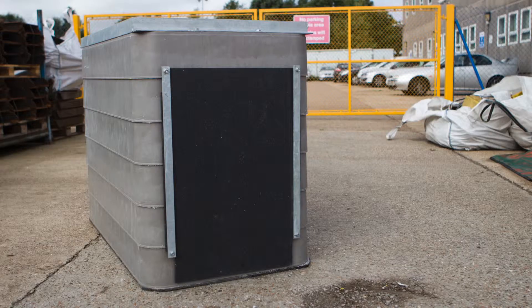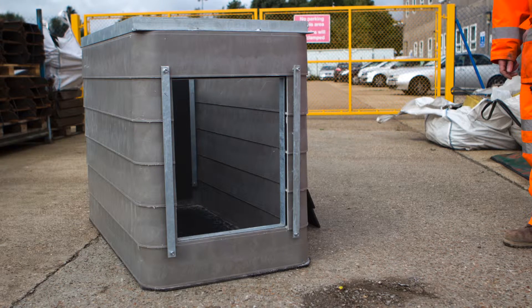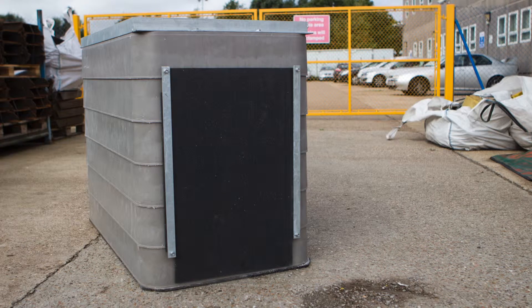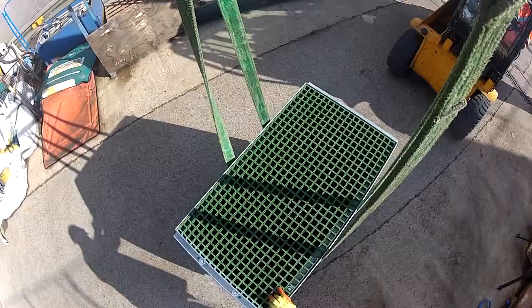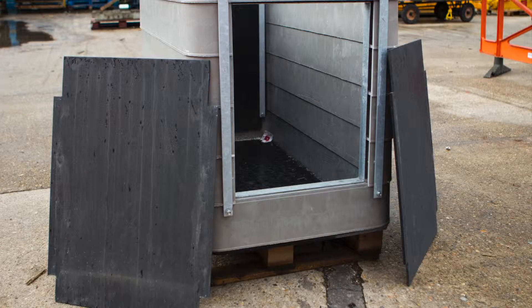The basic chamber arrives on site as a pre-built 900mm tall unit. It arrives complete with base section, blank ballast boards both inside and outside, and the frame cover attached to the top section. The ballast boards can also be supplied pre-cut and are suitable as a slinging point for positioning using the road rail vehicles. Ballast boards for each individual chamber may be supplied from stores or can be cut manually on site depending on each situation.